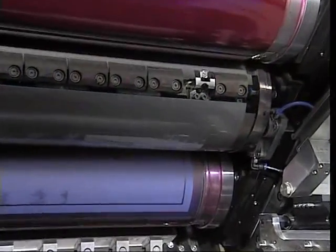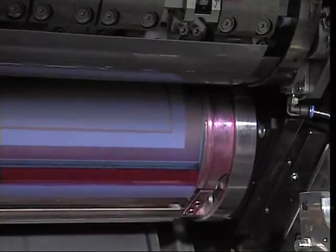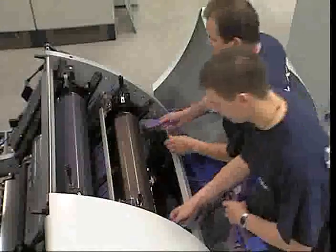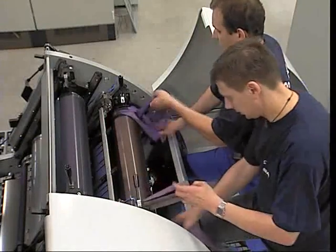All rollers and cylinders for the impression throw-in are bedded in linear guides without play and without eccentric bush. Bearer rings for inking rollers and plate cylinders dispense with the unpleasant task of adjusting ink rollers. Equally, when servicing is required, the rollers and cylinders can be changed quickly.